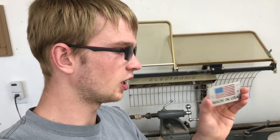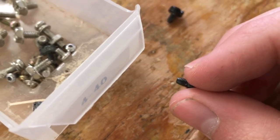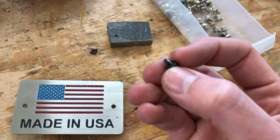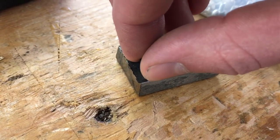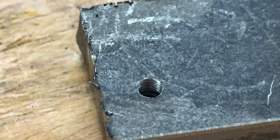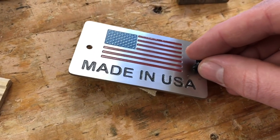So now I have to figure out how to mount this on the belt grinder. I drilled two screw holes for number 4-40 screws, but I don't have a tap for them. Upon looking in my collection I found these screws — I'm not familiar with this kind, but from the end they look triangular. I measured them with a caliper and they come in at about 116 thousandths. So I drilled a 113-thousandths hole and threaded one in. It actually works a little bit like a roll-form tap, because if you look carefully at that hole, it's threaded. So I'm just going to drill more holes at exactly 113 thousandths and screw it on.